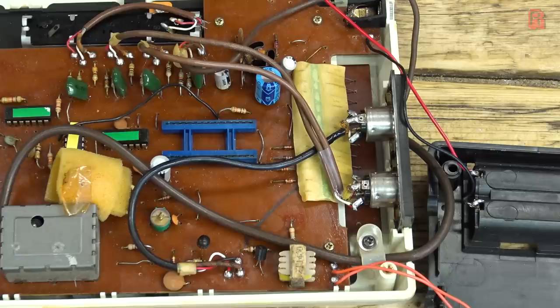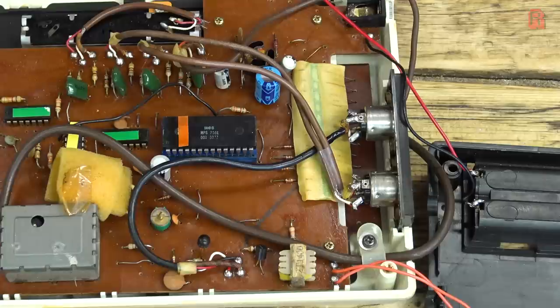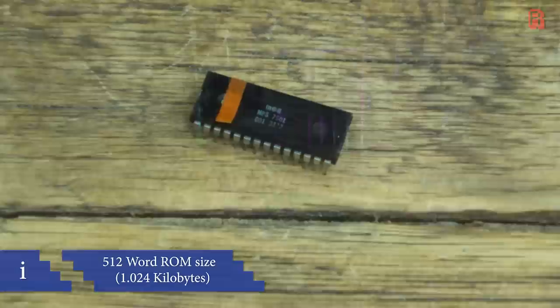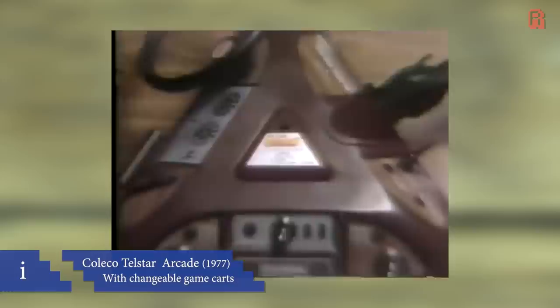Information on the core of the 7600 is very limited. Some speculate it contains a 6502 core; others that it's a primitive calculator CPU repurposed for games. Look around though, and there's a distinct lack of support chips — where's the ROM, for example? Well, that too is within the 7600, as is the circuitry to generate graphics and sound, which was emitted from the speaker built into the case rather than the TV. With the game code in ROM within the 7600 — capacity of 512 words or 1.024 kilobytes — once your games were baked into the chip, that's what you were stuck with. It's an interesting middle ground between the new generation of programmable consoles and discrete logic or Pong-on-a-chip-based devices.